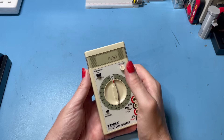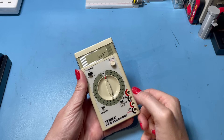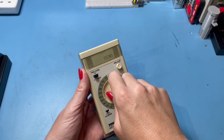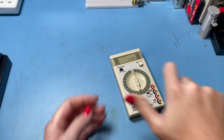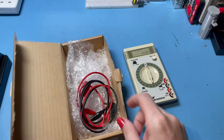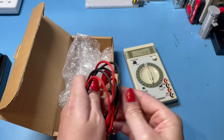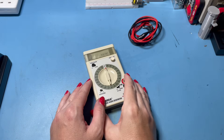So you've got your frequency range there - times one or times a hundred. Waveform: sine or square. And your attenuation from naught or minus 20 dBs. Sync and signal out, and you've got an amplitude control there. Selects your frequency and that's it - that is literally it. Came in this little box, not sure if that's the original box, but it did come with some leads. We've got banana to crocodile clip - that's always a useful combination. There were no instructions but it's a pretty simple device.